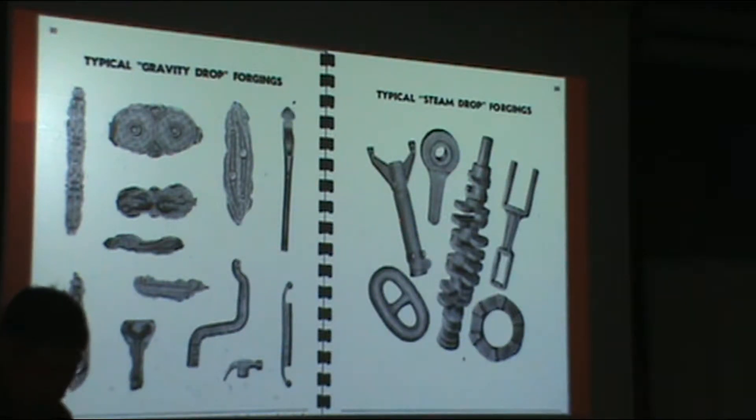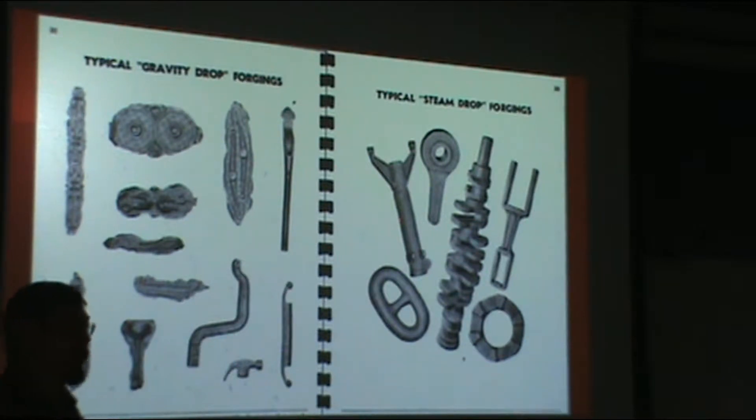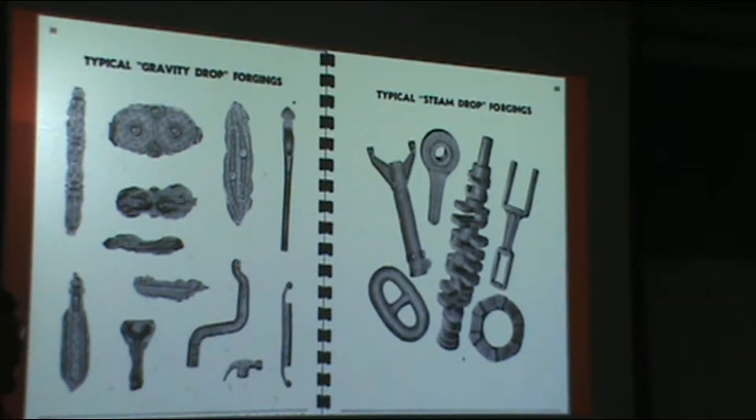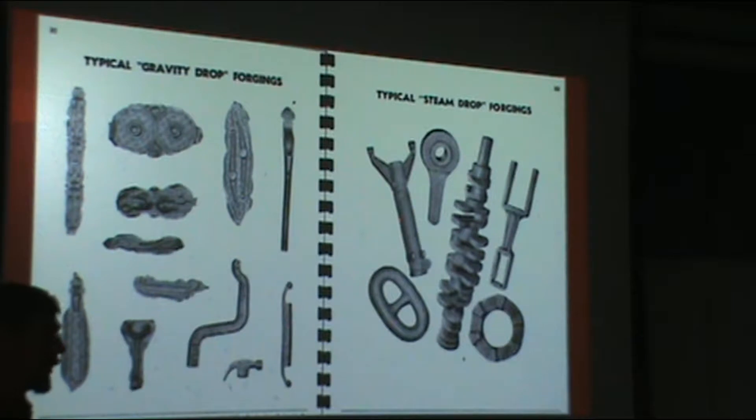Here are some illustrations of the output of the drop forging process. Almost all of these are shown as they come out of the dies, and we can see this extra metal called flash. It's trimmed off eventually, but it actually has an important role to play. The tools have to be designed in some cases to actually lock together because of part geometry — otherwise they would be forced apart or shift. You can also see that tools are set up to create multiple pieces in the same forging, called a platter.